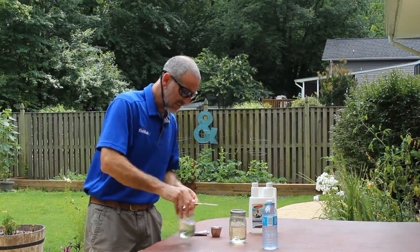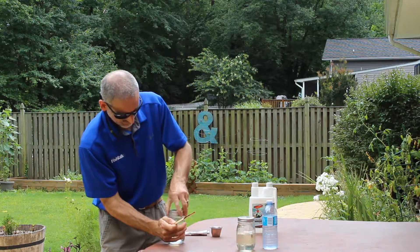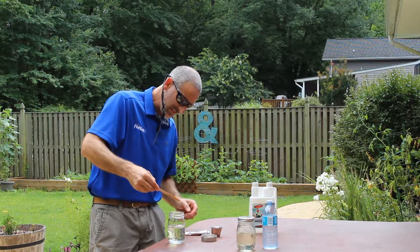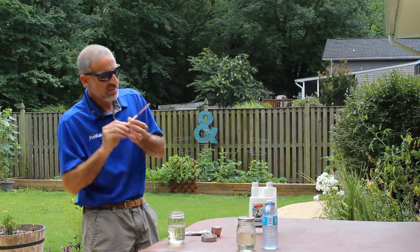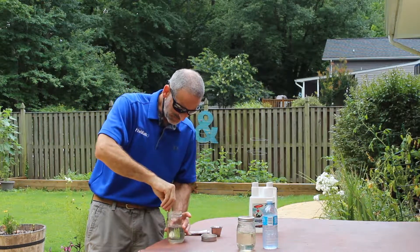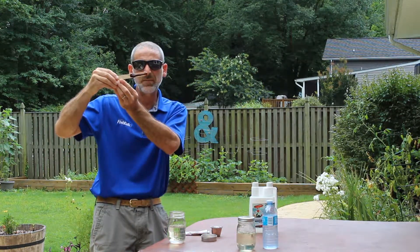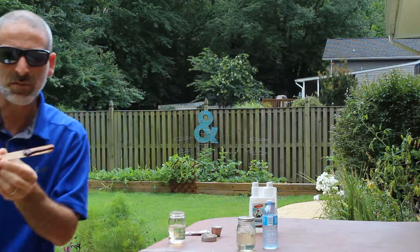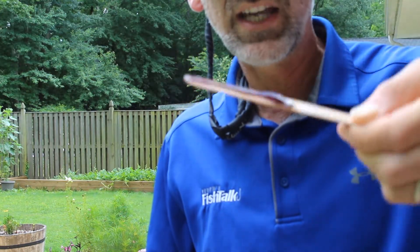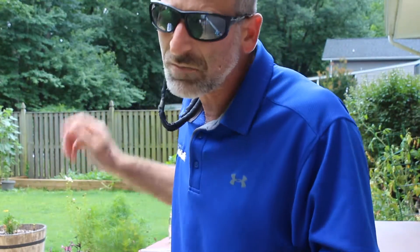Now just to see, we're going to try it in the control, which we know has water. All the way down to the bottom — and the paste turns red. Hopefully you can see that reddish color coming out in the paste. It is definitely changing color, it's getting red. See how the paste has turned from brown to red — that's indicating that the water is in there, which it did not do at all with the X2. So that's mighty interesting.